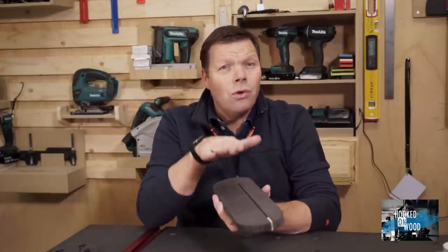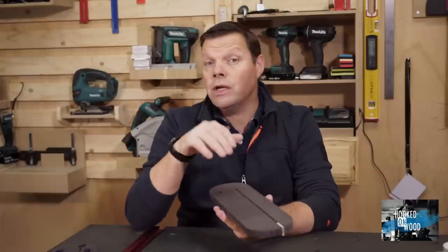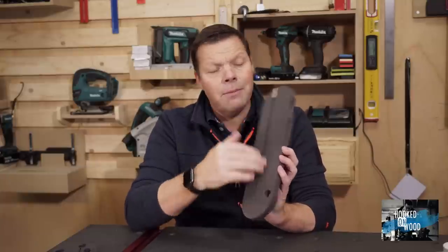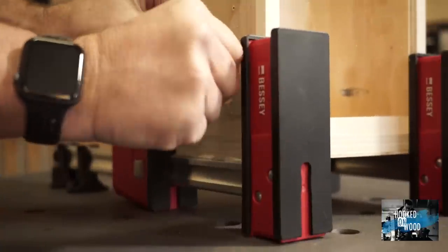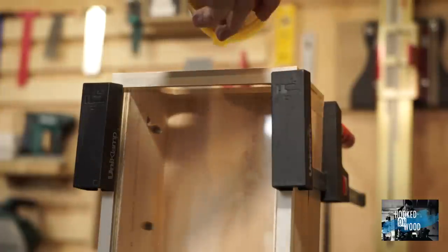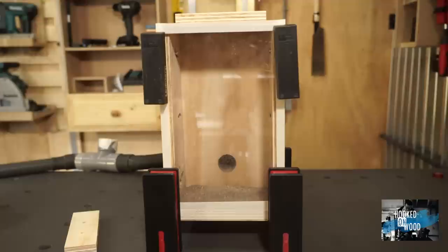I started to realize that my Zero Clearance Insert kills all the airflow, because your dust extractor can work as hard as it can — it can't extract more air and dust than the air it can extract. As you can see, the gap is very narrow, especially when the saw blade is in it. So what you do is make your table saw into a big airtight cap on your duct system. Here I made a small model that is supposed to be a cabinet saw. If you carefully close all the holes from your cabinet in combination with a Zero Clearance Insert, you kill the airflow in your system and probably nothing will happen.